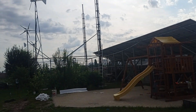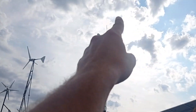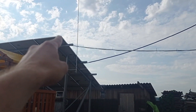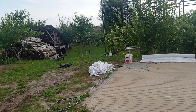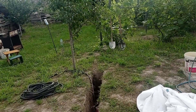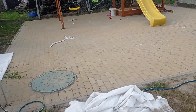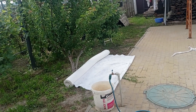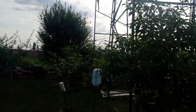I will never ever be burying cable underground like I did for these wind turbines — already one, two, and three. It all goes in the air, and inside like that, it doesn't have any troubles. You can easily change it, whatever — that's probably the best way to do this. Of course you have to use steel cables to hold it because the copper cable itself is quite heavy and it has to hold on something; it cannot hang on its own weight. That's what you have to think about.